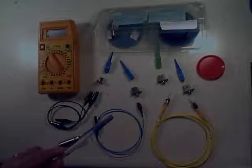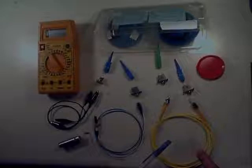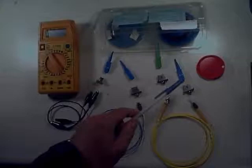The 2x2 coupler will allow us to take this single signal and break it into two beams. These two beams exit here where they enter into our fiber optic loop. I've got shown here a 1-meter jumper, but we're going to use a 40-meter cable since the sensitivity depends very much on the length of this loop. We also have various different adapters to allow these different connectors, which are of different kinds, to be able to connect together conveniently.